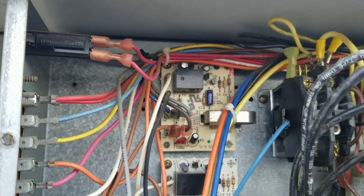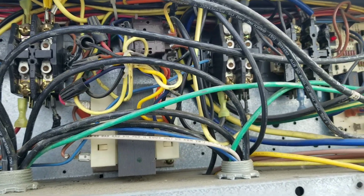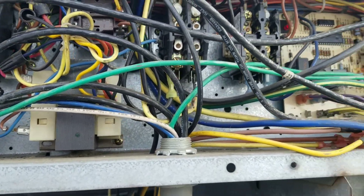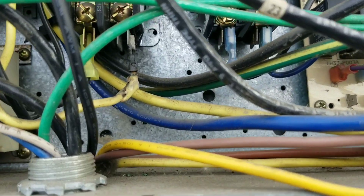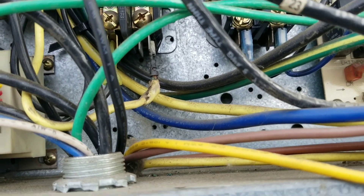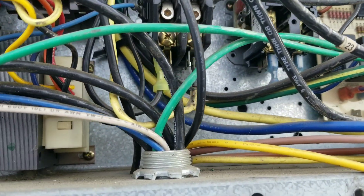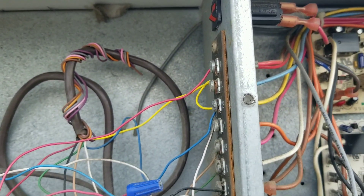I reset our little popper. Before I did, I visually inspected everything — I didn't see anything obvious, no low voltage wiring touching the chassis at all. The only thing I noticed was one of our contacts, that wire right there, kind of looks like it got warm a bit, so I'll have to address that. But I still don't have any cooling and I haven't verified if I have a signal for cooling yet.